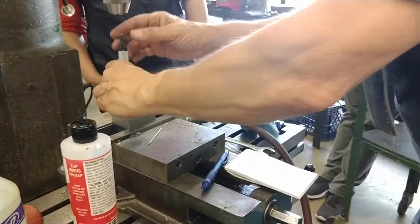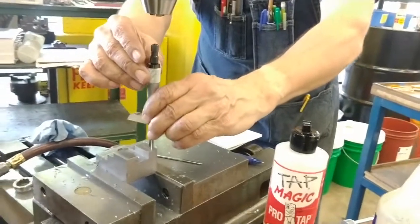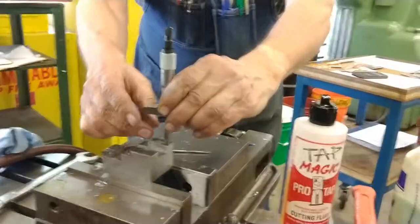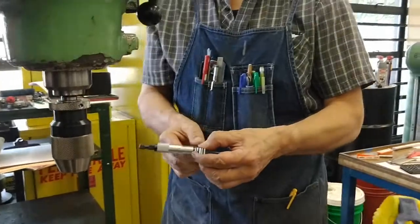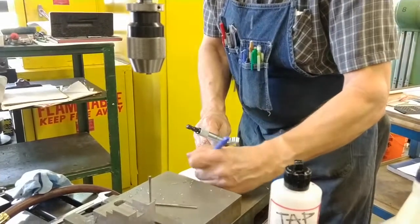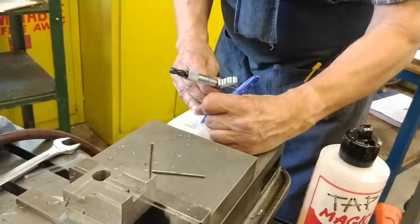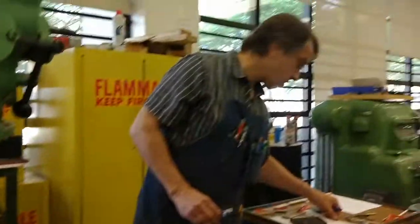We'll hold the mic exactly parallel to the rod. We have plus or minus 15 on this. We'll adjust the micrometer until the rod touches the surface of the part, and it's perfectly vertical, perfectly parallel to the part. And we are at 1 inch, 491 thousandths. Subtract it, and we will get our depth. 507 thousandths. Our tolerance is plus or minus 15.